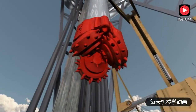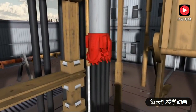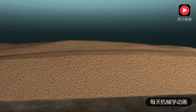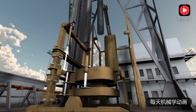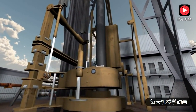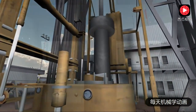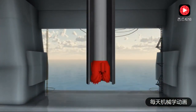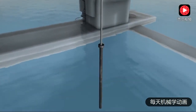It's time to drill the hole or well bore using a drill bit. This initial step is called spudding in the well. The shallow sediments just below the seafloor are often very soft and loose. To keep the well from caving in and carry the weight of the wellhead, a large diameter base pipe or casing is drilled or jetted into place. The base pipe is assembled at the rig floor and a drill bit connected to a drill pipe is run through the inside to the bottom of the casing. The entire assembly is lowered to the seafloor by the rig hoist.